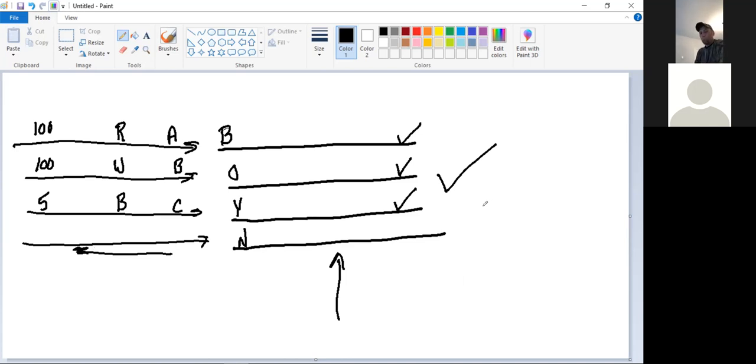Yes, sir. The way you ask it, it really bounces back to the earlier discussion. I'm not going to put a closed delta bank up there. It's way out of efficiency, and it's a huge cost for something I don't need, just to provide a little bit of load on the third high leg or on the three phase. But great question. Any other questions?